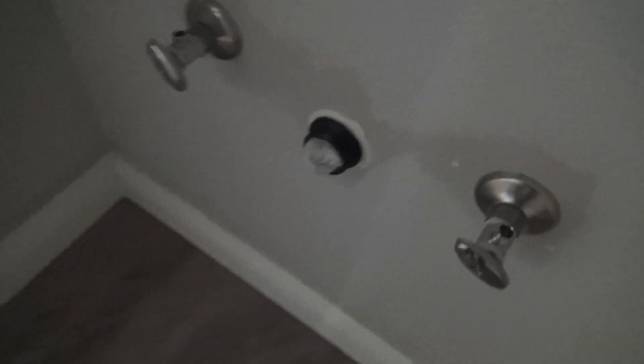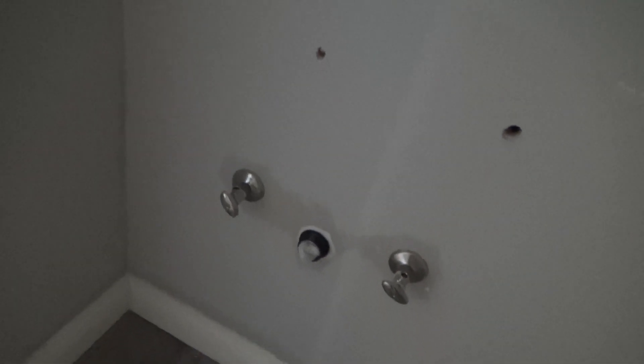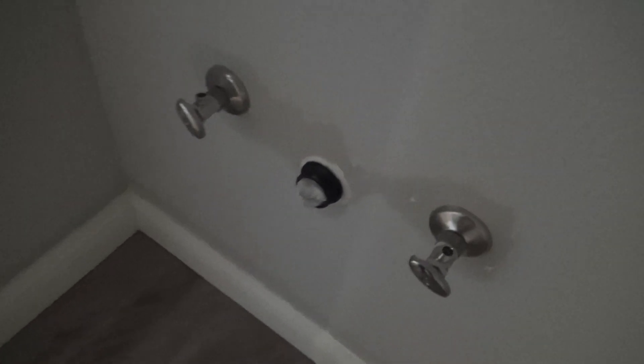This area is going to be a pantry for the kitchen, so I caulked all the sides all the way up to the ceiling on both sides to keep ants out. Where the pedestal sink wall outlet is, there was a big crack all the way around. The sheetrockers probably figured the painters would handle it, and the painters figured the drain line trim cap would cover it — so nobody caulked it. But now I've caulked it and I'm ready to paint.